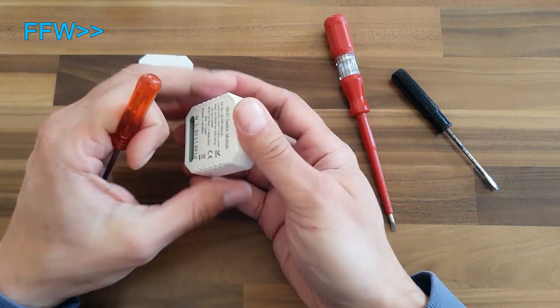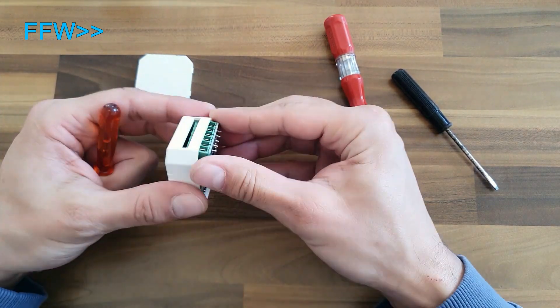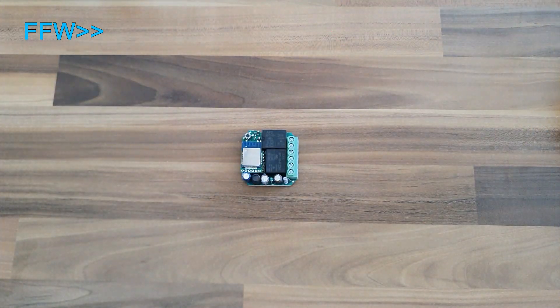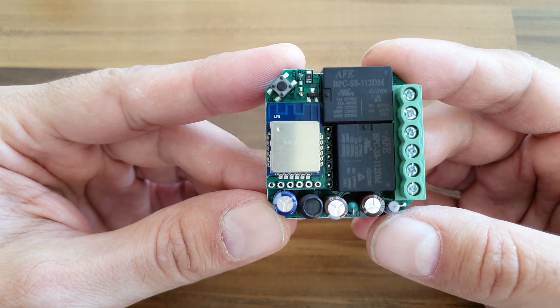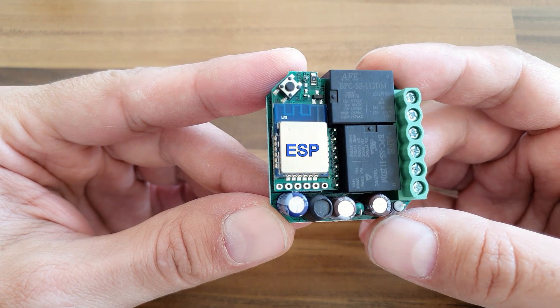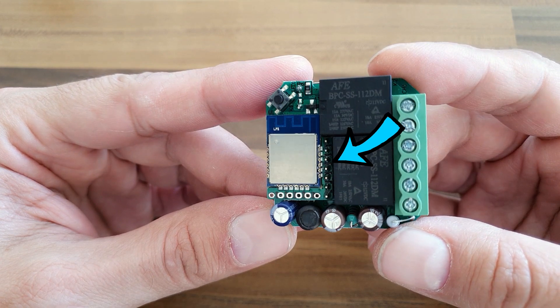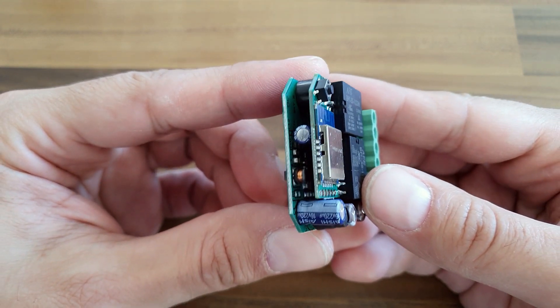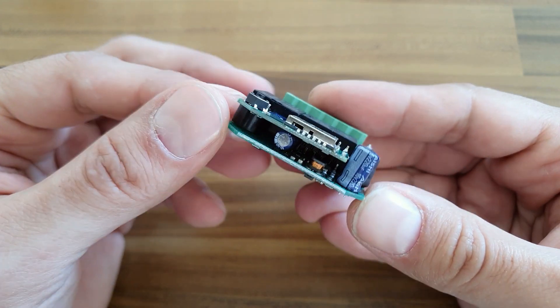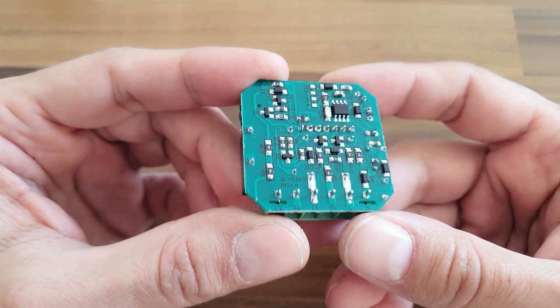At the end, push electronics from the front. You might take advantage of the side hold too. Let's take a closer look at the electronics. There are two relays, some passive elements below, and our point of interest — the ESP Wi-Fi module on the left, as an add-on board connected via seven pins. You can see there are even some useful holes at the bottom of the add-on board. We will flip the module around. We can see there are no optocouplers, so we swim in dangerous waters.